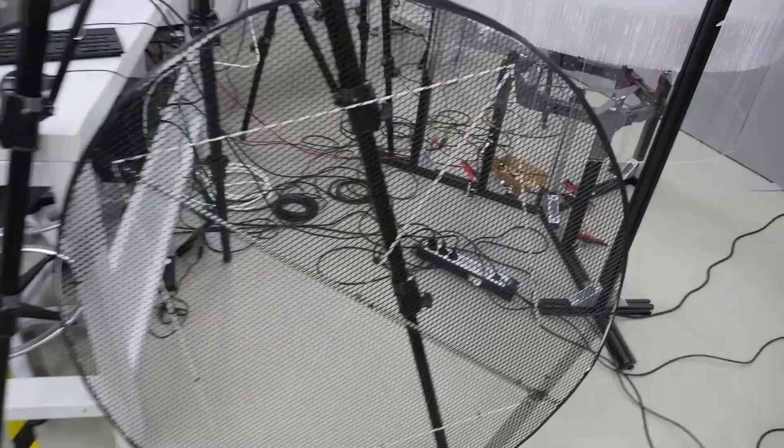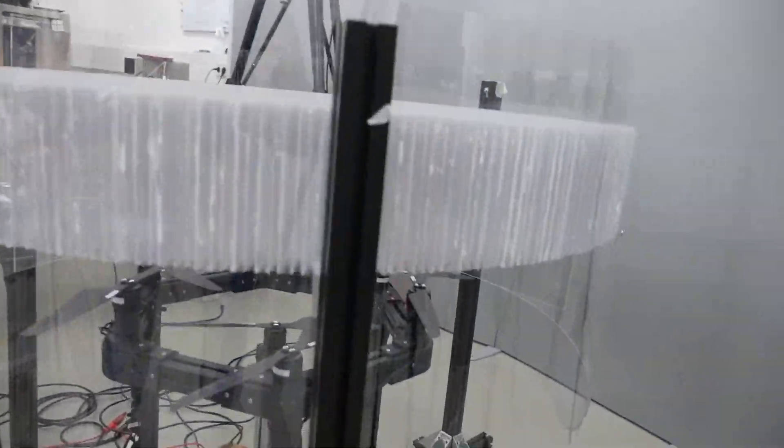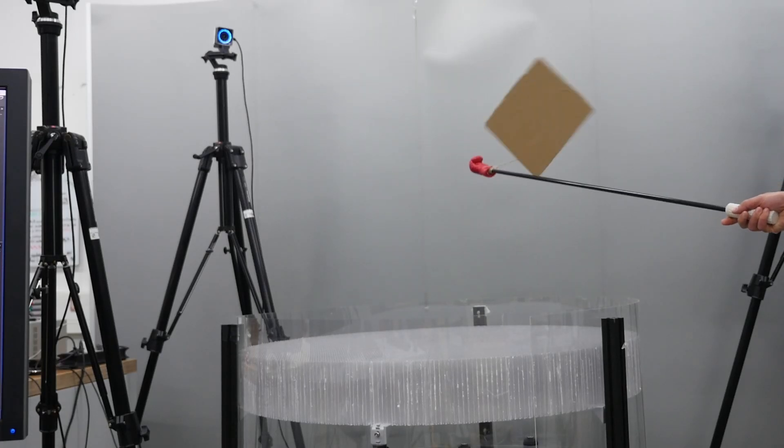After some tests, there were several issues with the wind tunnel. The airflow at the center was weak, so I added another motor in the center. Additionally, the airflow had a lot of turbulence and small vortices were still forming. To solve this, I replaced the metal grid with an air straightener — a layer of 14 cm long tubes. This layer ensures that the airflow is directly vertical and significantly reduces both vortices and horizontal air currents. That's how we end up with a wind tunnel capable of generating airflow speeds up to 11 meters per second. If anyone is thinking of building a wind tunnel like this, anything placed above it shouldn't have any screws or bolts that could loosen from the bottom surface — due to vibrations, a screw might come loose, fall into the wind tunnel, hit a propeller spinning at high speed, and shoot out like a bullet. Of course, this never happened to me — it's just a random thought that came to my mind.